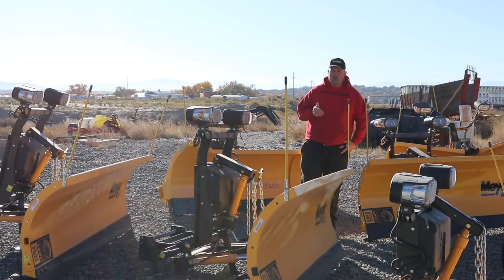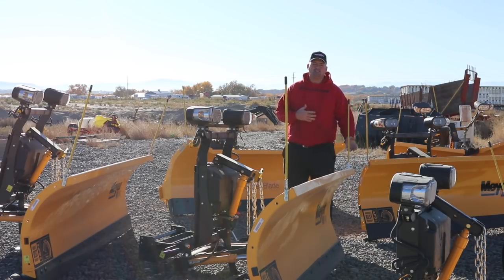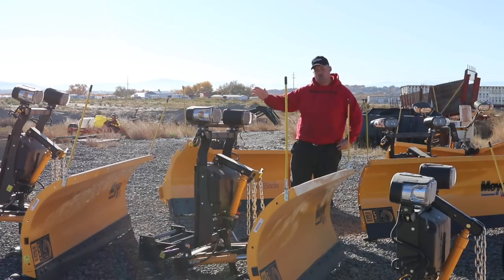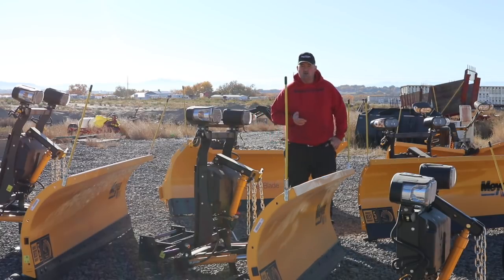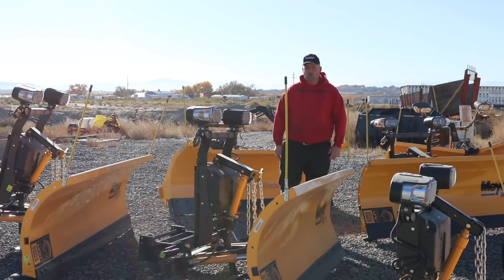With the Lot Pros, we keep that plow in a 7.5, an 8, usually an 8.5, and a 9 — and we can get it up to 10 feet wide. Meyer also has fixed 45-degree bolted-on wings for the edges that will turn a 7.5 into an 8.5, which makes the plow more of a carrying blade rather than just windrowing snow to the side — kind of a semi-U shape like a dozer. We can also put deflectors on the Lot Pros and Drive Pros to keep snow down and out of your windshield, and Meyer has hydraulic adjustable wings as well.